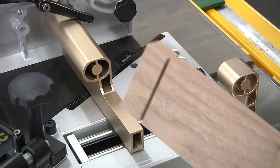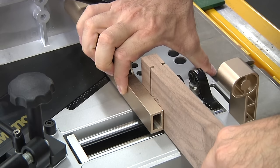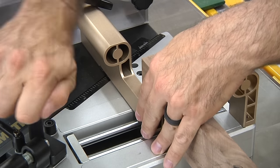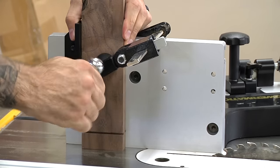In a very similar fashion, I'll take my tenon workpiece, put it in front of stop block two, and bring it back until it makes contact. With very light pressure, I'm going to tighten down the body with this knob. Then on the other side of the jig, I'll take my workpiece, clamp it in place against my stop, and now we can make our cuts.